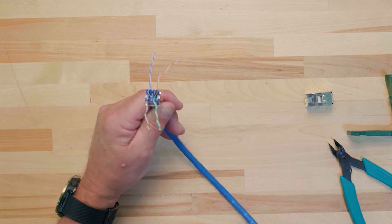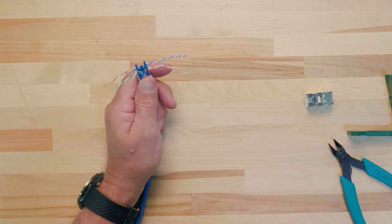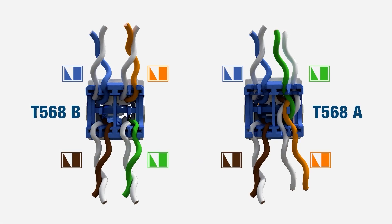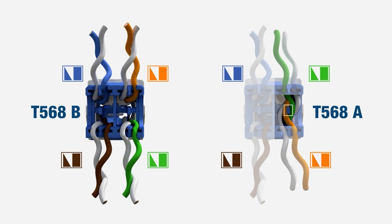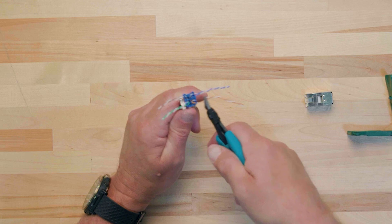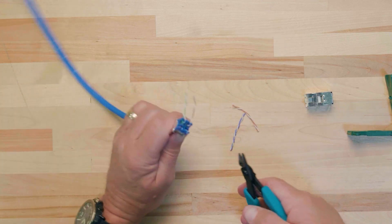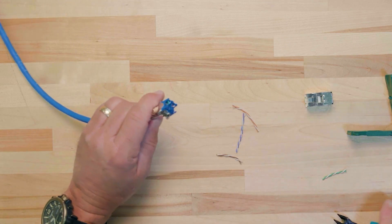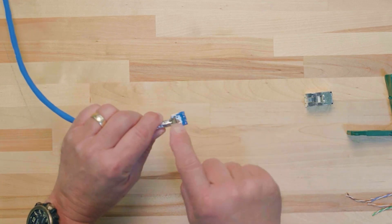Double check that all conductors are fully seated in the correct location and position. Note: if you are terminating a Panduit copper connector according to the TIA 568-A wiring scheme, you can swap the position of the green and orange conductors after they've been inserted into the wire cap, before they are seated into their respective grooves. When routing the conductor pairs, cross the orange and green conductors around the post with the green pair positioned to the outside of the post. Once all of the conductors have been properly untwisted and seated, bend them perpendicular to the cable and wire cap and snip them flush with the outside wall of the wire cap. If the strain relief is placed on the jack properly, the conductors will not move inside the wire cap and there is no need for excess wire.